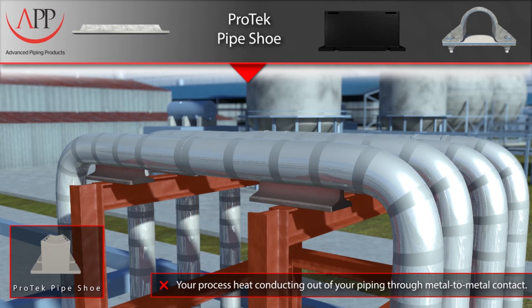If you are using stainless steel and your environment contains chlorides, every point that you weld on the pipe will be more susceptible to chloride stress cracking. Having the metal T-slide extend through your insulation and resting on the I-beam can also result in a heat sink with a loss of energy 24 hours a day.